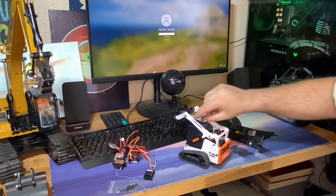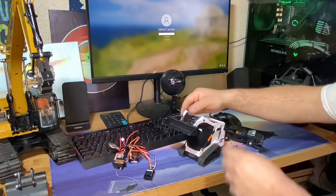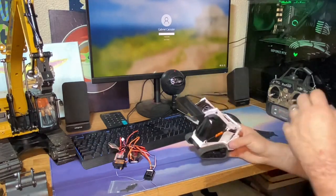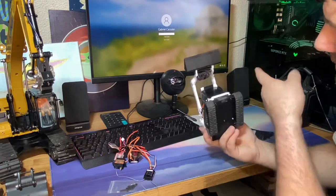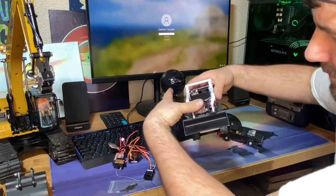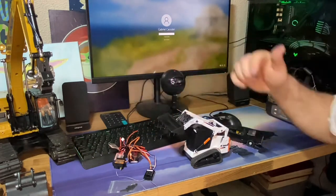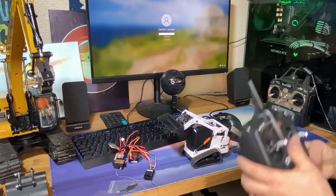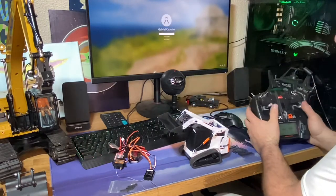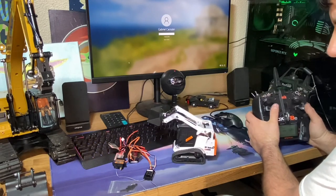It's pretty strong. This is metal and that's metal — that's pretty thick plastic on both sides. This little support beam — I'm glad I stiffened up the front. It used to bend and wobble. Look at it — it's much, much stiffer by doing that. I'm so glad I did that brace. It still has this one right here and obviously still has that one right there. It did have these little things that stuck out and I cut them so the servo would be flush up against here so I could figure out this linkage. I think I'm going to get a different linkage — I should be able to roll this bucket back all the way to here and then roll it all the way down. I'm improving on that. I'm going to adjust it in the radio too — a lot of that is learning to adjust it and set it up properly. It never gets old. And then you can do it slow — obviously it needs expo.